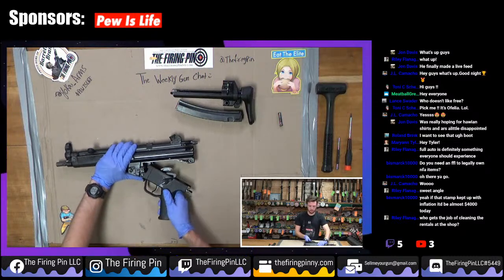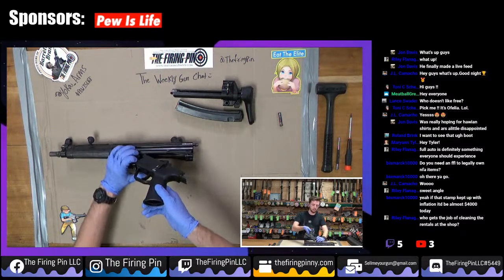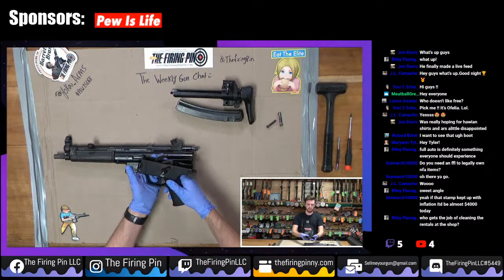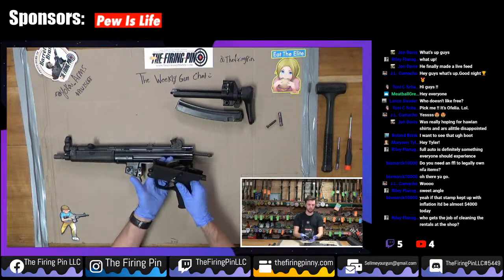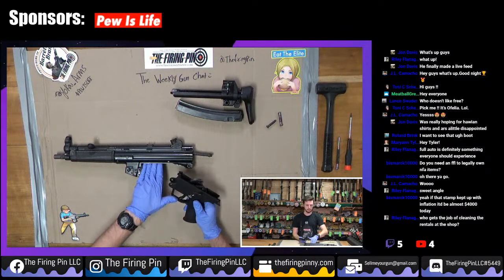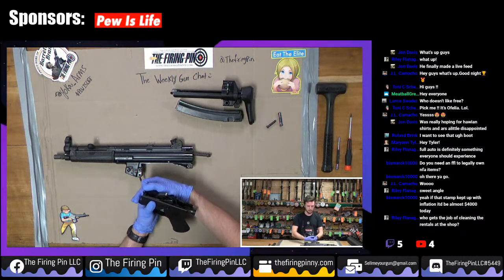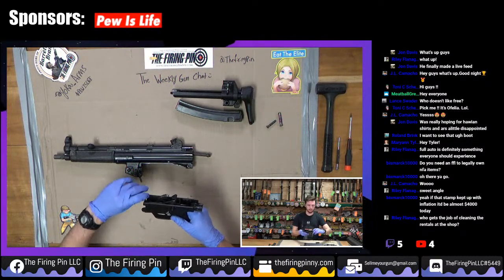Now we're going to hinge open basically our pistol grip and our trigger mechanism. We got another handy dandy HK push pin right here. We'll pop that out, place that over with its friend. And here we have the really cool part. This is what makes this gun here a machine gun. Obviously there's subtle things inside the bolt and all that make it fully automatic, but these pieces in here that you see moving around that I'm pressing on with my hands, these are serialized parts.